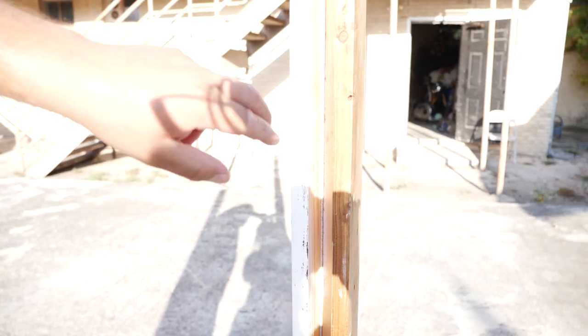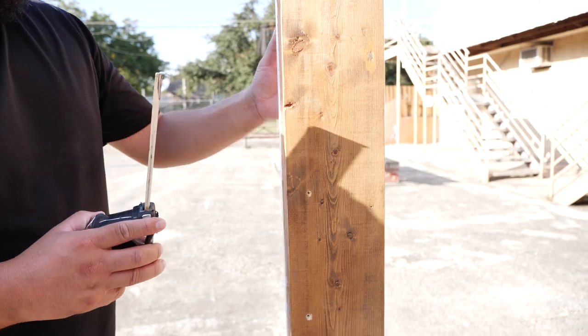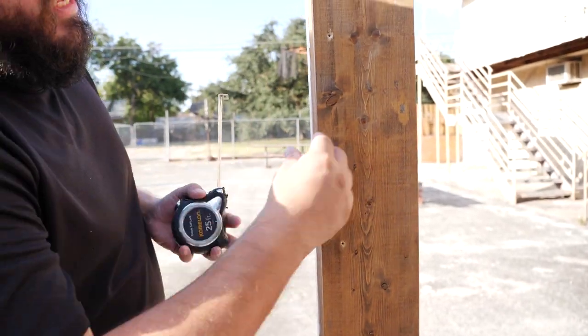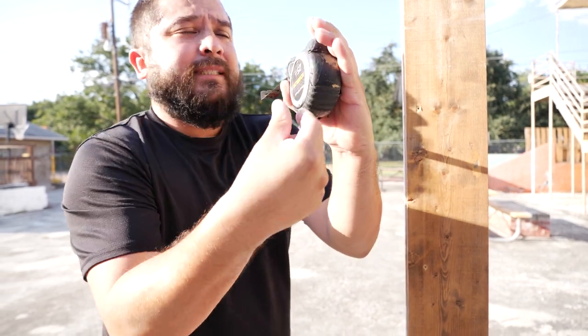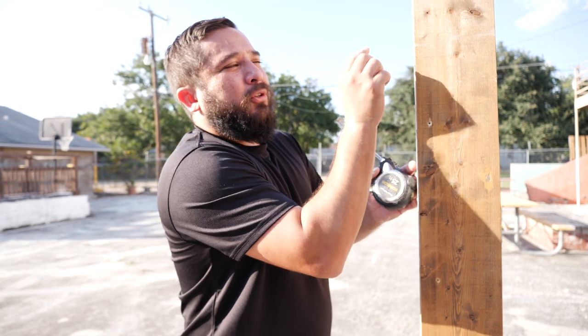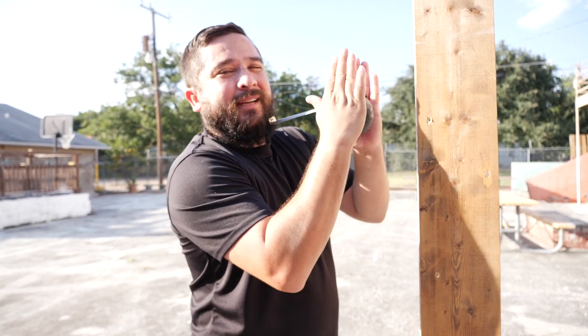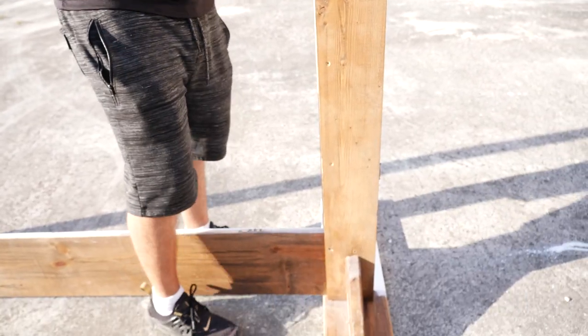And then as you can see from the inside, I added two of those masonite boards on both sides of the sandwich. So what I did here, this is a 1x6 and this is a 1x6, and all I did is I got a 1x3 and I sandwiched it in the middle. Then I added those little thin masonite 1x3s just to make it a little wider, so these boards will slide right in instead of being snug.